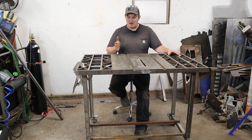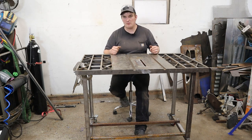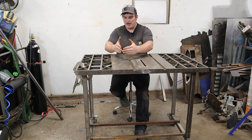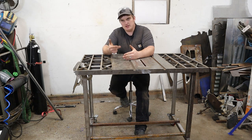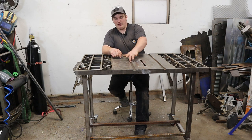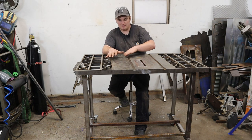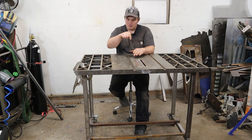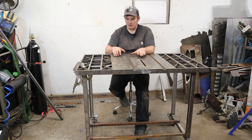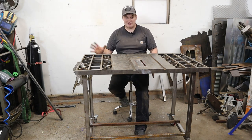Something I found really cool on a couple of projects is these grooves. Whenever you've got a corner joint and you're welding the inside or outside of it, sometimes if you want to finish that joint out, you end up getting a little weld or booger on your table. What I found is that once everything is tacked and fixtured down, I was able to maneuver those welds over these little crevices and make a full pass on the weld without worrying about welding it to the table — a nice bit of versatility.